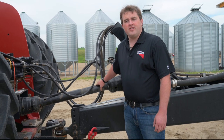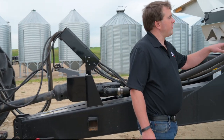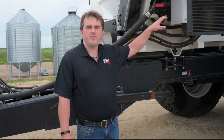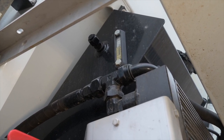With the PTO drive we have a hydraulic reservoir to keep the oil. The hydraulic reservoir is back here and tied to it we have a radiator which cools the oil. It's operated on a temperature switch so when the oil warms up to a certain temperature it turns the fan on to keep it cool, so that you can stay working in hot conditions or for extended time.